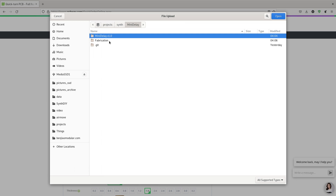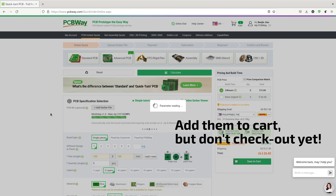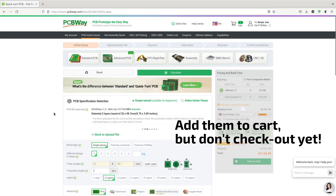Like my earlier modules, I designed the circuit and PCB on KiCad. I exported those into Gerber files and placed orders for the front panel and the main board on the website. For the assembly service, I had to prepare a bill of materials that contains specific information about the parts I need them to install.